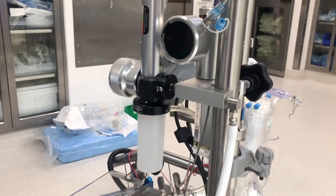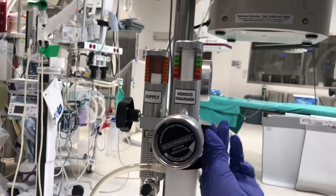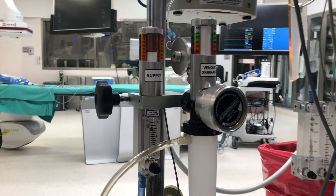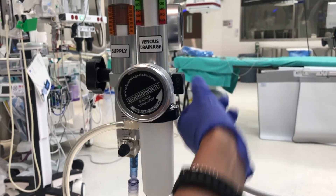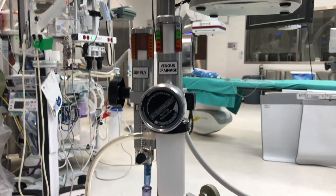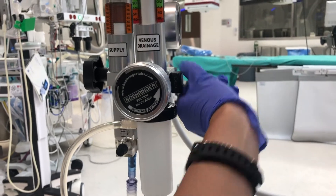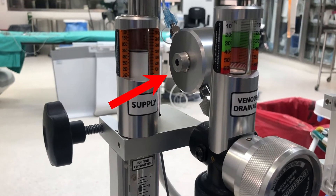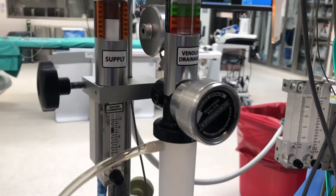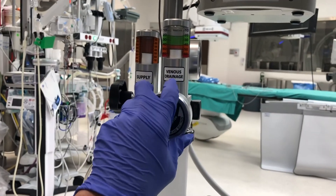In the off position, the circuit is fully vented via two five-millimeter ports in the back of the regulator. To apply vacuum to your circuit, turn the square control valve to the right position. The unit will turn on to the last setting it was at. To adjust vacuum up or down, use the large control knob on the front of the unit. Turning this counterclockwise turns vacuum up; clockwise will turn vacuum down. To turn off, use the control valve on the right hand side of the unit. Never turn the knob all the way clockwise. The VAVD has an independent factory set safety relief on the back of the device. This will start venting at positive one and negative 85 millimeters of mercury. In the negative position, it will whistle and keep the circuit below negative 100 millimeters of mercury.